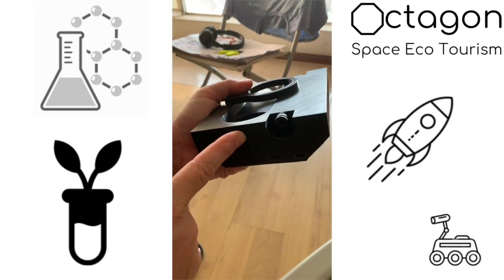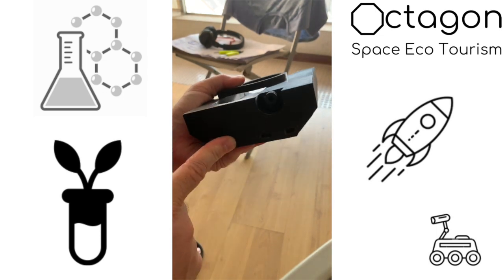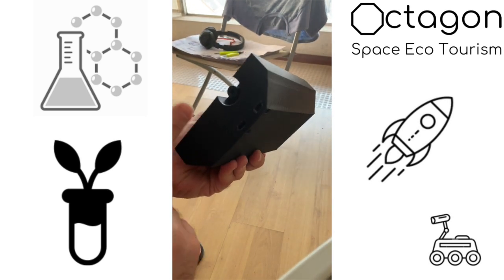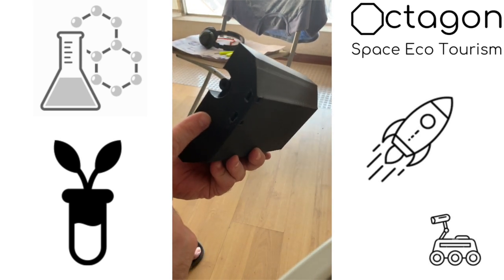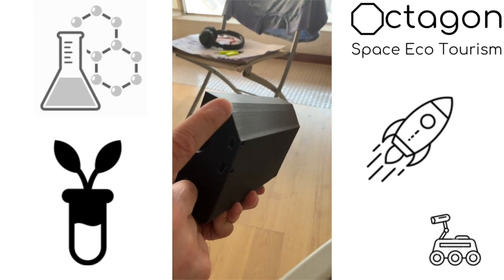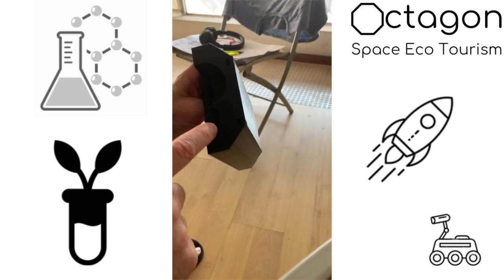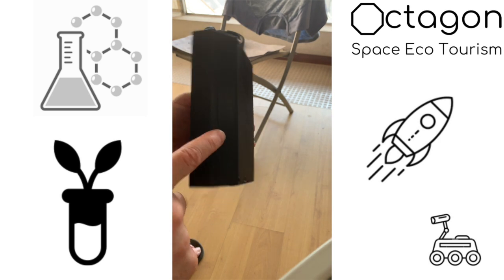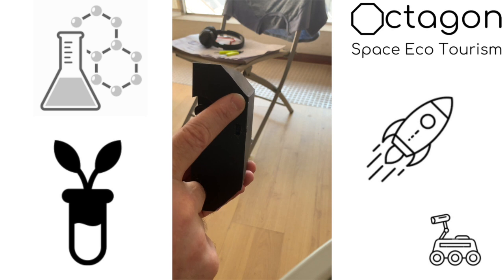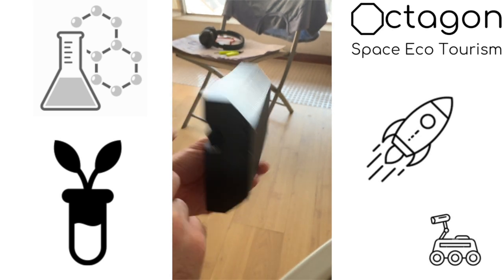All of this, obviously, I'm using 20% infill just instead of the regular 40%, just to try to save on a little bit of plastic. Made some mistakes over here. The zigzag infill is not the best. I want to switch to cubic so hopefully I can solve some of these defects over here, this little line, which actually has to do with how this joins up with this guy. And obviously I'm getting a little bit of elephant's foot, I think they call it, which is kind of at this level.